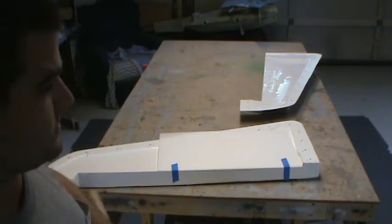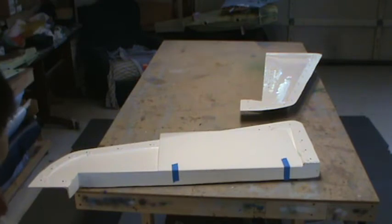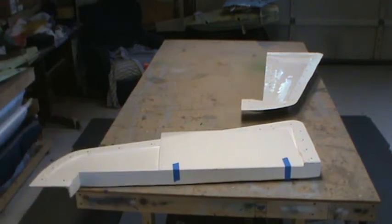That way I can try and cut down on the amount of time it takes to cut all this stuff. Just for the internal parts, just to cut the glass layers and the fill ply for all of that, and then the glass, it took a little over an hour. So anything you can do to eliminate time or save time works out better. In the future, for all those internal parts, I'll just take a piece of balsa wood of the right thickness and I'll glass the whole sheet of balsa at once. And then I'll send it to either the CNC cutter, or they can spec it themselves and source it. But if things work out well and I can pick up my own CNC router, I'll cut my own parts and I won't have to worry about it. Unless, of course, it's cheaper to outsource.